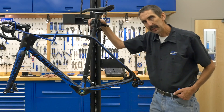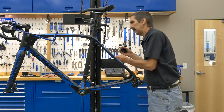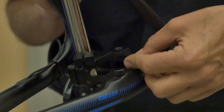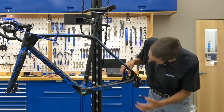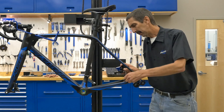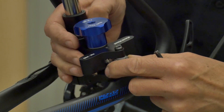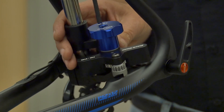The DT 5.2 can actually face this new standard. It uses these small little post or alignment studs — one inserts in the front, one inserts in the back. All it does is raise up the surface that lets us properly align the cutting arm to our cut. These come out, and we are then able to pivot our blade into the hole, and we are ready to face.